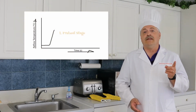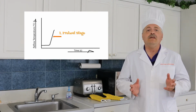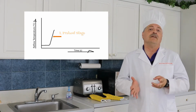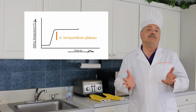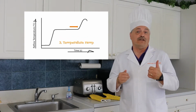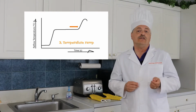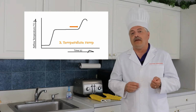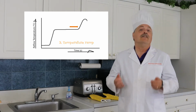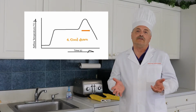First, the preheat stage, which heats up the board to the temperature between 150 and 180 degrees C for about 1 to 2 minutes. Second, we turn up the heat to allow the solder to melt. The temperature is ramped up to 230 degrees C, and the boards go through a 240 to 260 degrees C flash baking, where the solder reflows and covers the lead wires. Finally, the cooling process occurs to allow the circuit board to return to normal temperatures.